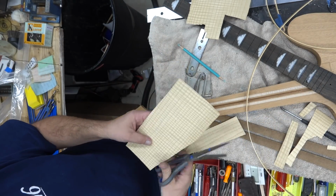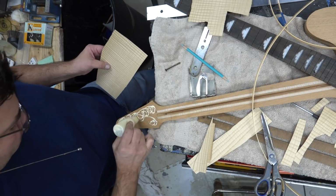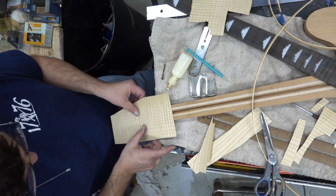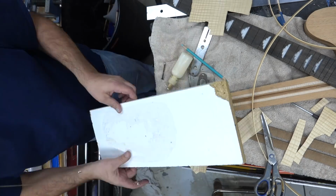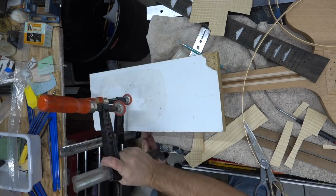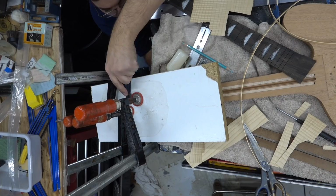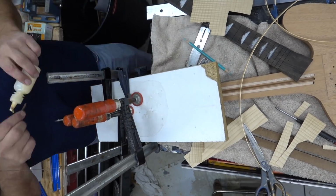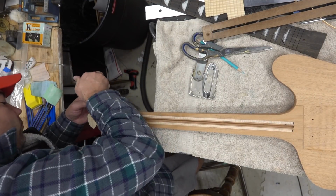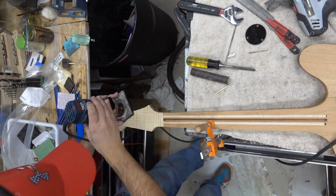Gonna go with a veneer on the top. Thought we were gonna go with an interesting stain technique that I posted that we ended up did not like. But we're gonna add some glue, clamp this down, let it dry. Trim it before we route it. So I've got my Colt router and a bottom bearing bit. We don't want this to tear out.